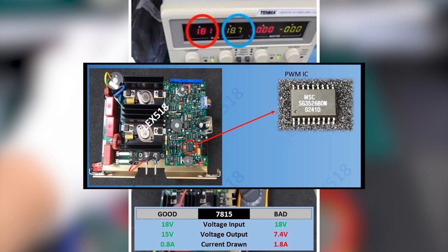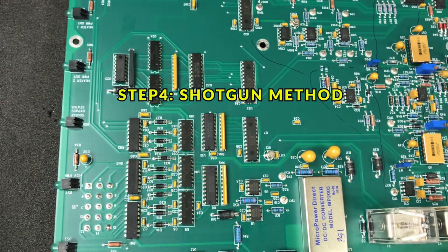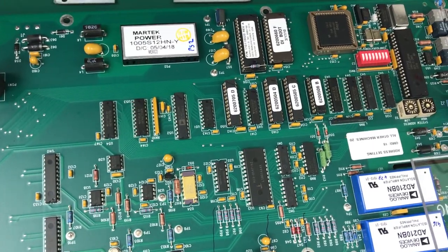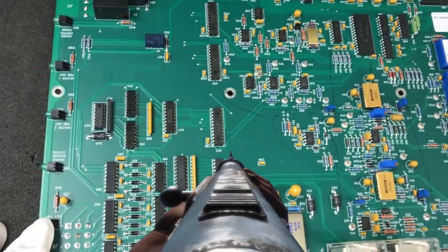This method is very useful: just power up the board with the required voltage and look for voltage drops or over-current readings in the circuit. For the fourth and final step, if no defects are found in the first three steps, I proactively replace components — especially ICs that I believe are more related to the failure. Some people call it the shotgun method: just replace all the ICs you suspect and bring it to testing.